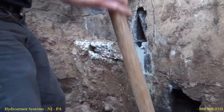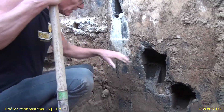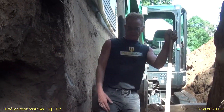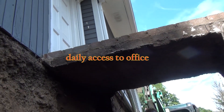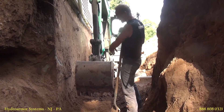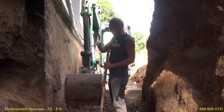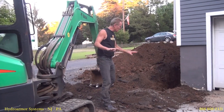Your center block corrodes — look at that. This is no big deal: we're going to fix this with wall pins inside to solidify the walls, we're going to do a gravity feed with no pumps. It's tricky because I wanted to save the bridge over the ditch. The other thing we're doing on this job is pouring a new garage floor, because that was heaving and broken, and this foundation is a mess.